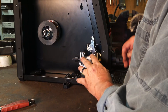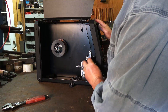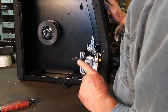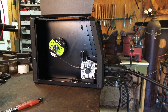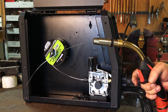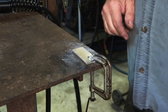This is the other roller — we've got to make sure we're using the U-groove for our particular wire. I'm using .035 so I'm putting in the U .035 roller. I also like that you can get to everything easily — a lot of the older machines you can't get to this area very well. This is very well thought out; YesWelder listens to their customers, I really like that. I've got the torch stretched out in a straight line and I'm going to try to get it in. That worked — now let's get set up on some aluminum.